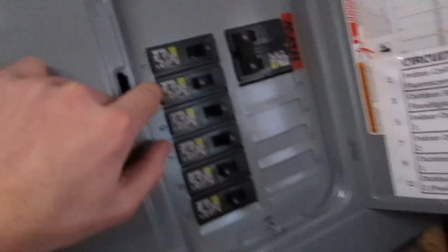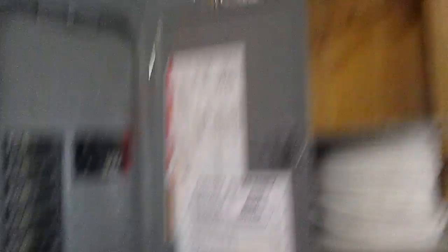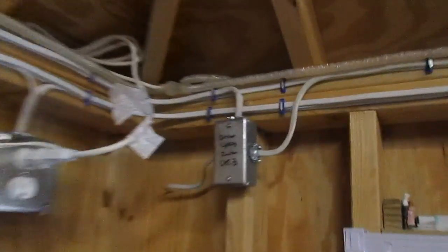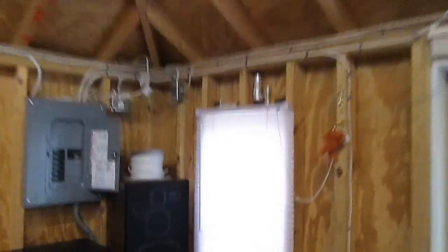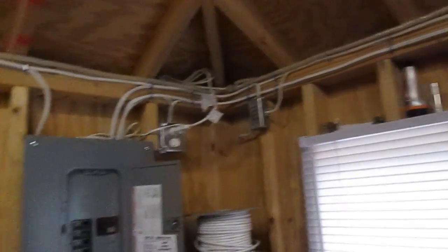We have the labeling for the indoor lights here. These breakers are rated for switch duty — SWD — although they're not turned on and off a hundred times a day. They're turned on once in the morning when I'm out here and shut off at night. The wiring comes out; we have these labeled and the boxes. This one's for the outdoor lighting, with a dedicated breaker. As per the NEC, exposed Romex can be exposed as long as it follows the building's contour of the wood.